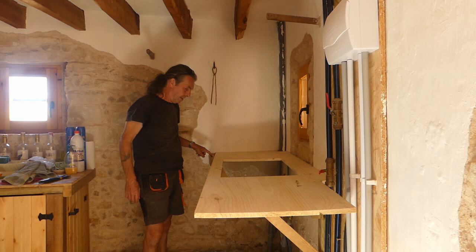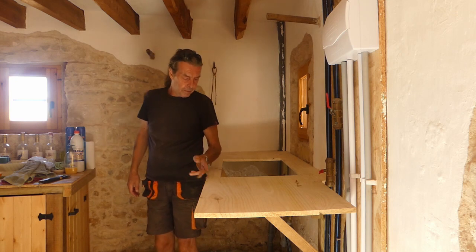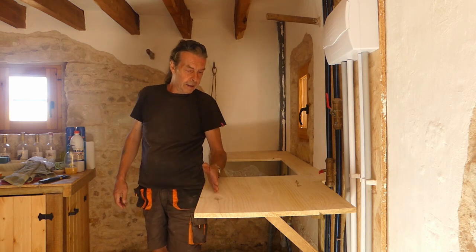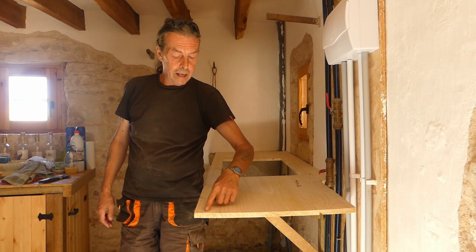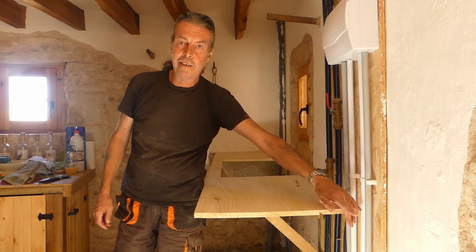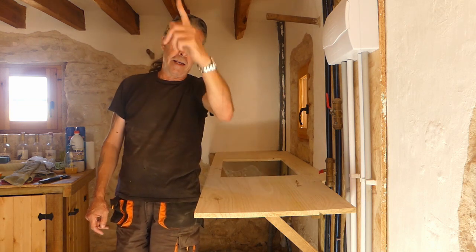As you can see, the frame just completely needs remaking, with the exception of probably the back piece and much of that side piece at the back. What I want to do is get a line and get an angle on this to get it parallel-ish, so I'm not going to have this sticky-out corner as we're walking past — just taper it back. It's also too short, so I'm going to attempt to glue the piece that was cut off back on to make it longer. These are made from pine boards that are glued together, so if they can do it, I'm sure I can glue a little piece on the end. I'm going to mark this and take it back to the workshop to get it cut.